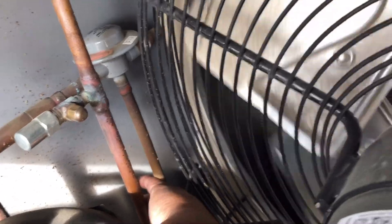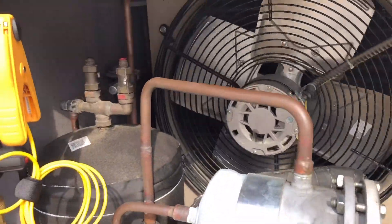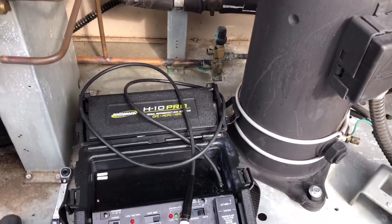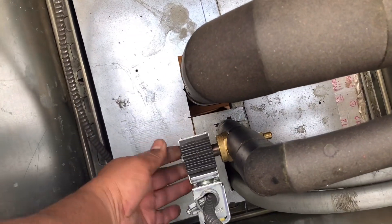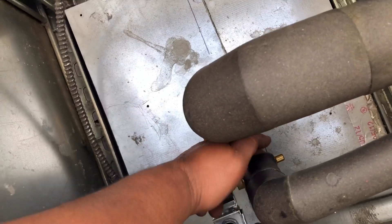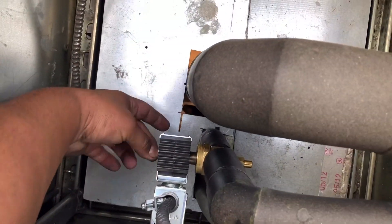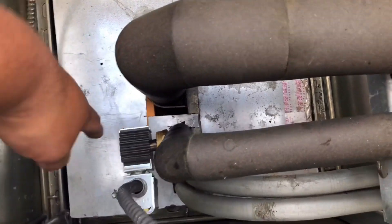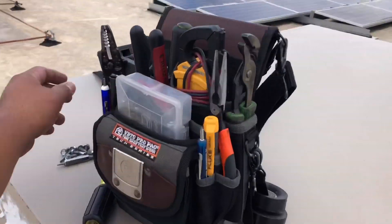We're gonna go on top of the box. I know that's where the other technicians have previously had leaks — both of them said it was on copper 90s, so maybe that's just bad copper from the install. We'll find that out today. There's a solenoid located in the plenum at the roof penetration. I just took that off — here's our solenoid. We're gonna see if this guy's not leaking somewhere in here. It's just hand tight, so I'm gonna stick my leak detector in here.